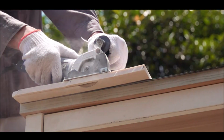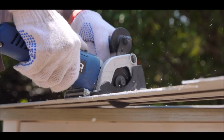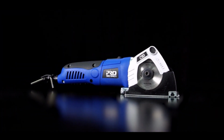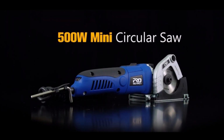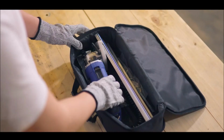This 3 3/8-inch mini circular saw features a compact, lightweight design that makes it easy to operate. Designed with a 4.2 amp motor and 3500 to 6500 RPM variable speed for handling applications. Comes with guide rails, so the mini circular saw ensures a straight and precise cutting line for cutting wood, plastic, metal and tile.